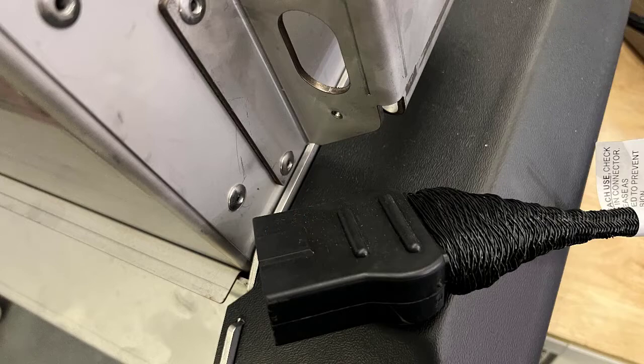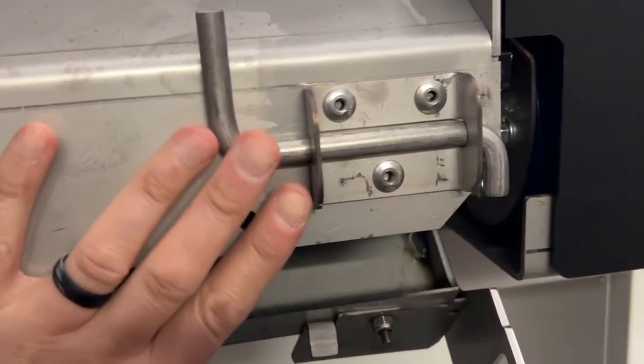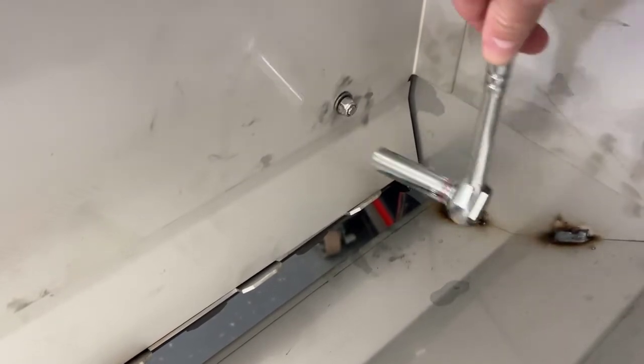To adjust the flap agitator, disconnect the spreader harness from the vehicle harness. Rotate the locking pins so the trough can be lowered. This will empty the hopper of whatever material is left inside. Once the lid and top screen are removed, loosen the 3 nuts that hold the flap agitator in place.